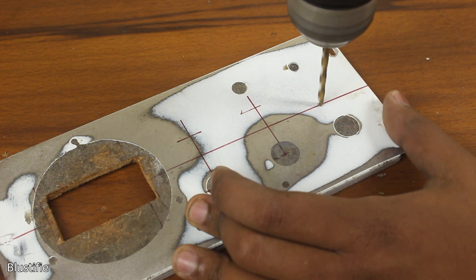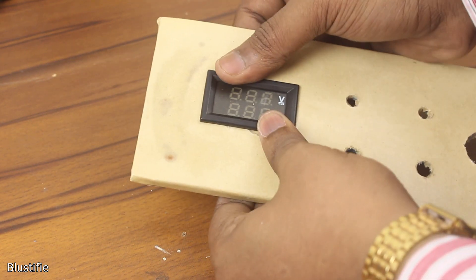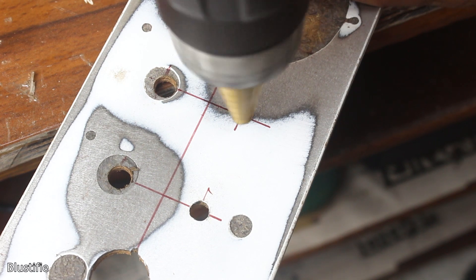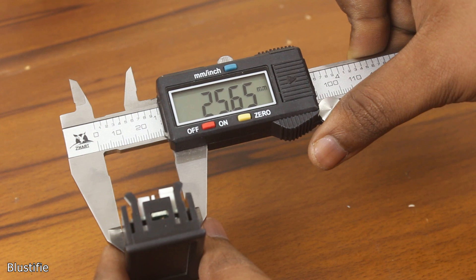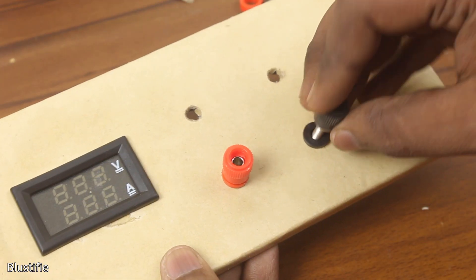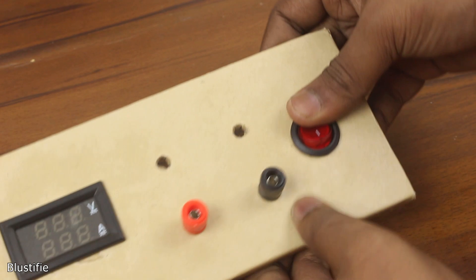At the front side plate, I first covered the hole of the analog meter with MDF and made a suitable hole for the digital meter. I also made a couple of holes for the potentiometers, binding posts, and a big one for the switch. Before cutting the holes, I took all the measurements with my caliper for accuracy. Let's assemble the parts of the front plate one by one — beginning with the meter, then the binding posts, and finally the switch. The potentiometers will be added later.